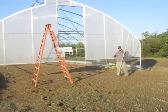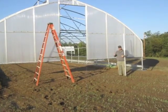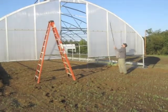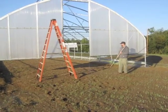Polycarbonate has an inside and an outside. Only one side is UV protected. So when you get polycarbonate, it comes with a protective sheet. It's important when you take off that sheet to mark which side is out. So in this scenario, it's really important that we have it marked, and we also have to mark any of the pieces that we trim or cut off so that when we use them later, we also know which side is going to be out.